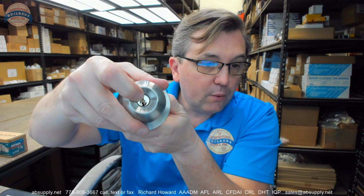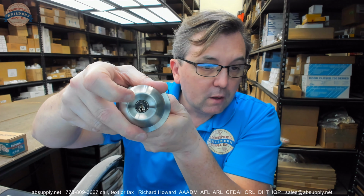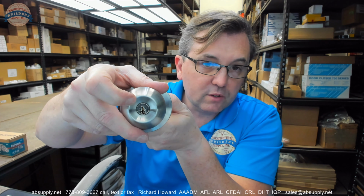Now, I did find that, and this is very true of imported locks as well, when I took an original Schlage 6-pin blank in another Kwikset lock yesterday, in fact, the key did not go into that cylinder broaching very well. It did not go in very well. That's not hard to believe. So be mindful. Using original equipment on this, like that key blank, might prove to be a challenge. You may need to be mindful of purchasing original Schlage blanks.